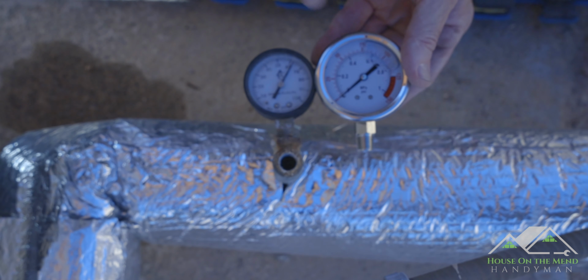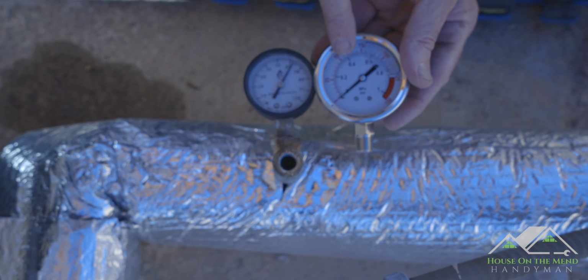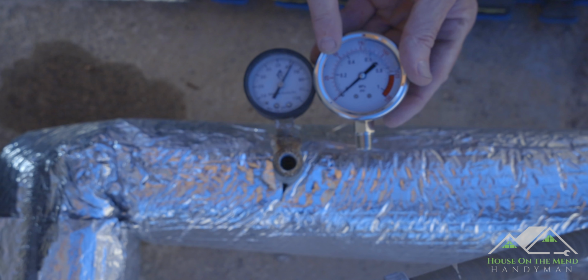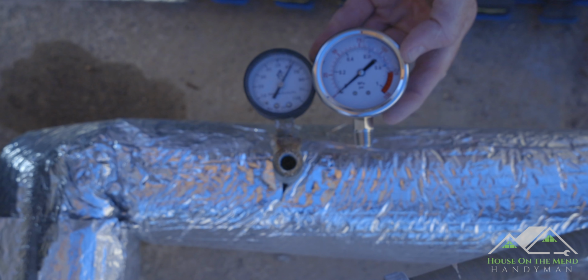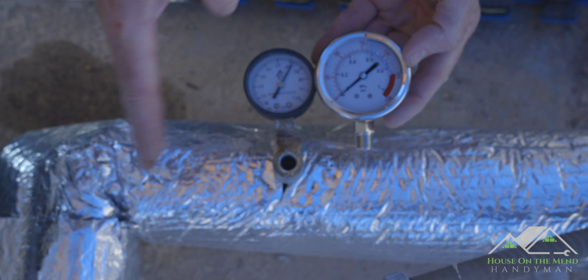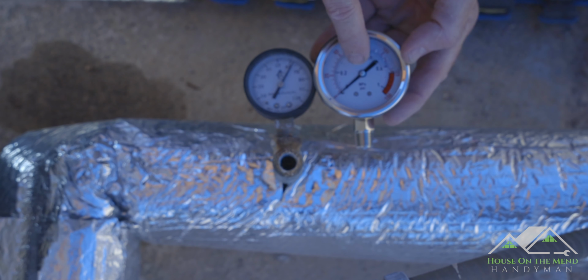And that is gonna do two things. Number one, it's gonna help keep this guy from freezing or overheating. This one's rated for -4 degrees Fahrenheit all the way up to 140 degrees Fahrenheit. So we don't reach either of those here in Las Vegas. We do get below freezing, and we of course get into the 115 range, but this guy should be able to handle it. But also this liquid inside, when there's vibration going on, it dampens that vibration so it won't have so much wear and tear on the needle and the gauge inside.